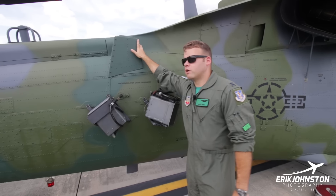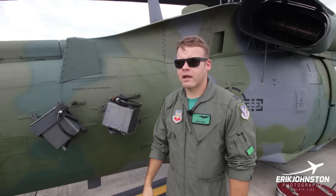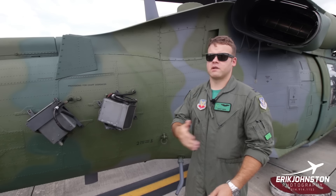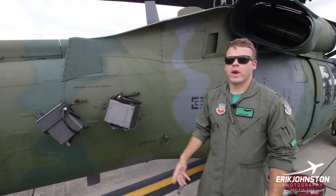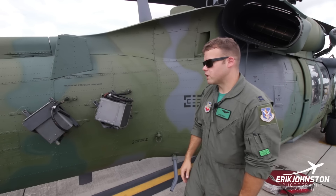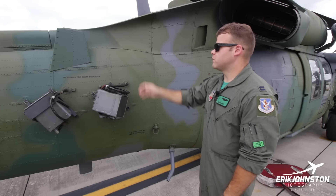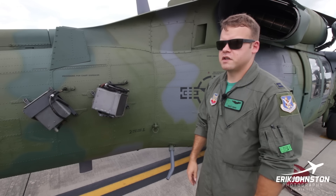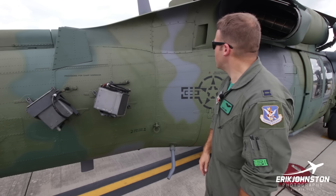This is one of our GPS antenna receivers. The original Blackhawk only had a Doppler — decent for ground speed and track, but it doesn't know where it is in the world. When the Air Force got the Pavehawk, they said we're flying low-level long-range missions, so they paired a Doppler with an INS, and when GPS was available in the early 90s, added GPS too. More recently, we've replaced those with dual EGIs — embedded GPS/INS — so there are two INS units with their own GPS receivers. They're very accurate and resistant to GPS jamming, and worst case if GPS is jammed, we have dual INS to continue the mission.